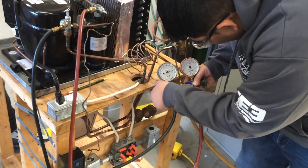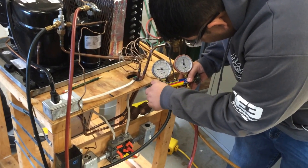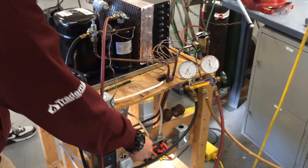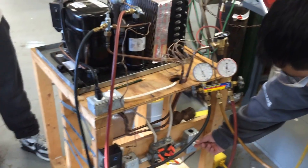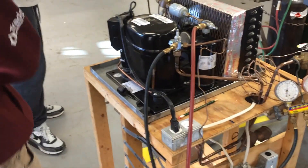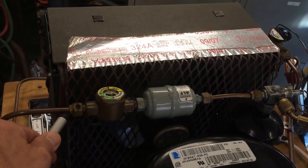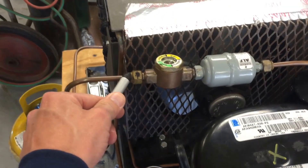Shut her down, open her back up, and get her back up to 100. Now run the unit for just a minute because by running the unit you're mixing the nitrogen and the refrigerant — but we don't want to run it long. Now take your electronic leak detector and sniff out where you think it's leaking, because you've got more pressure now to let that leak detector work. Move it at about one inch per second for every half inch — hear how the tone's changing on the leak detector.